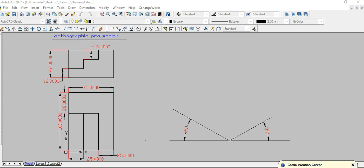Hello friends, it's me Madan Baju. Today I'm here for the isometric drawing of this orthographic projection. To make the isometric drawing of this orthographic projection, we have two different approaches: one is making a box, and another is without using a box.